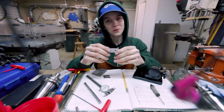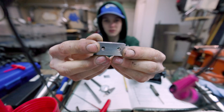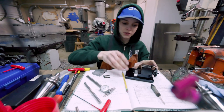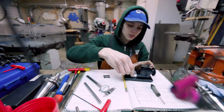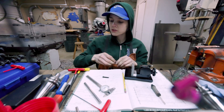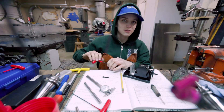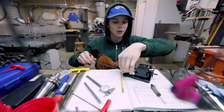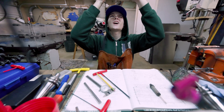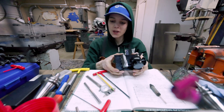Second time's a charm for me today — I messed up the first time, as usual, but I am very, very pleased with the block. Nice and square, rectangular-ish, got the hole for the original pin on the bottom, and it fits absolutely gorgeously — just sits right down where it needs to. It's pretty much a perfect fit for the carbide block, and to top it all off, the screws do thread in nicely. I had to rob a couple off the milling machine because I don't have any long countersunk M5 screws, so I'll have to go get some tomorrow. Everything bolts up nicely, and when I hold it up to the light I do not see any gaps, which is awesome.